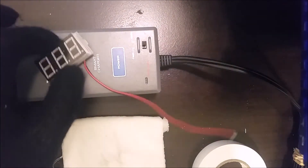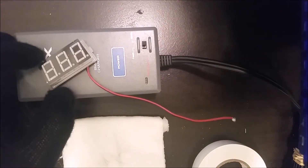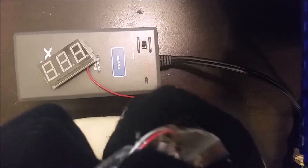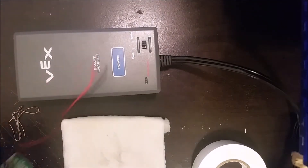Get your charger and your voltmeter display. It might be different — there are ones with two wires and ones with three wires. If yours has three wires, just connect the white and the red when soldering them together and it should work fine. For this, I'll use the simple red and black since it's easier.